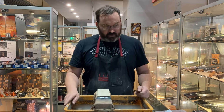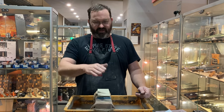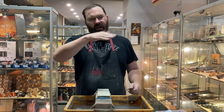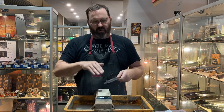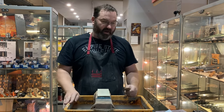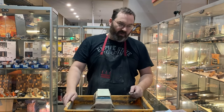Dished out stones. Why isn't your knife getting sharp? You've probably got a combo stone — maybe 10 years old, a thousand-grit combo, 6,000 — and you've sharpened and sharpened and sharpened. Now your stone looks like a half-pipe skateboard. If you're using that kind of stone on that curved surface, your edge is also round, which is then rounding the stone, which is then rounding the edge. So flatten your stones.